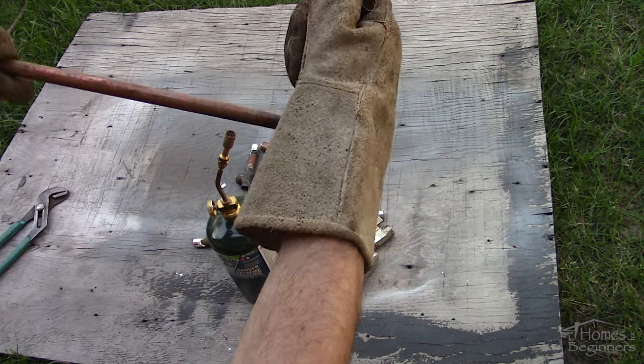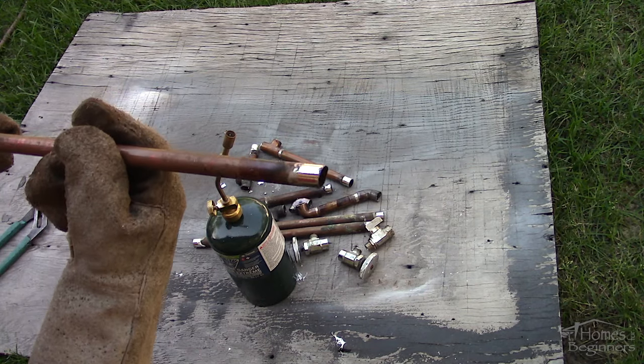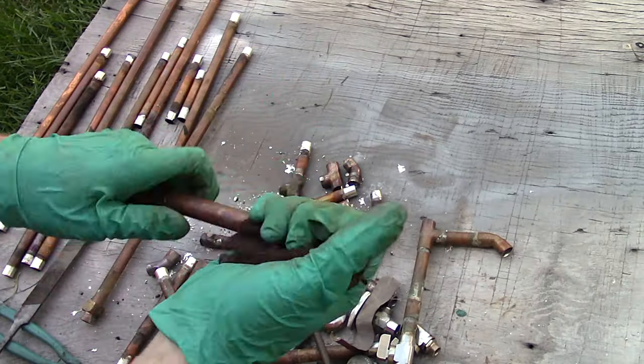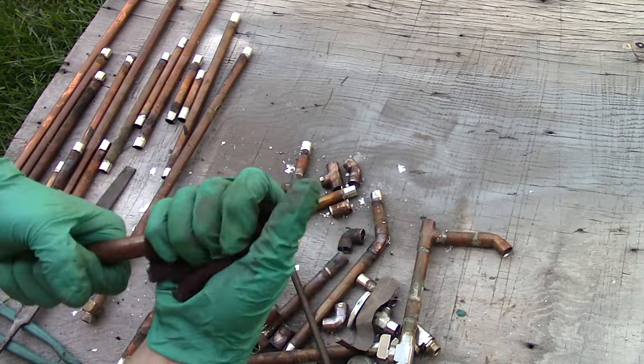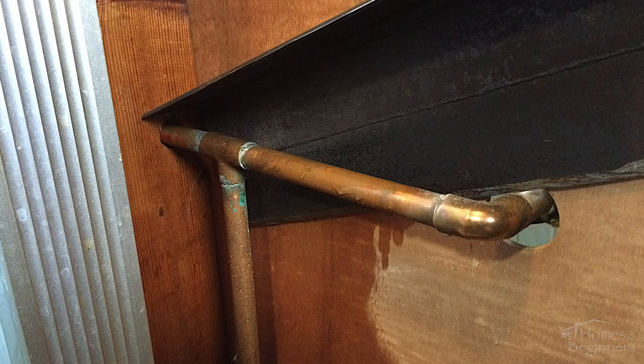When working on water pipes, make sure you do have the water supply turned off. If you are working within studs, floor joists and other flammable areas, it's always important to take the proper safety precautions so nothing becomes damaged or you cause a fire. When working around wood, I use a spray bottle with water to coat the wood, then I put a steel barrier in place as a primary form of protection.